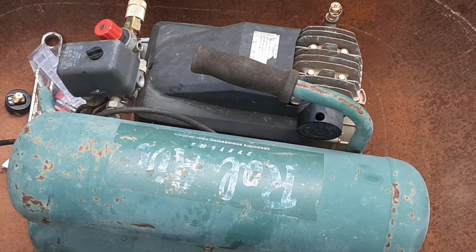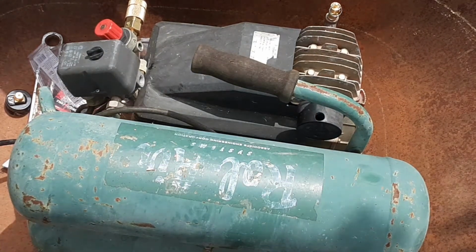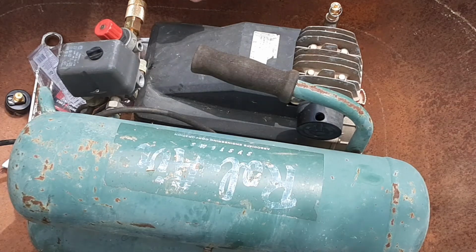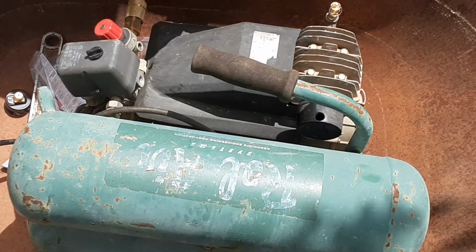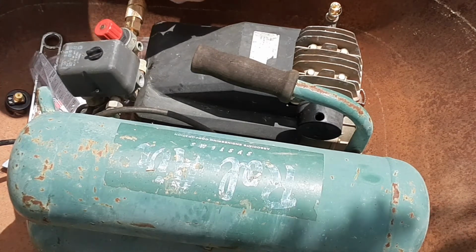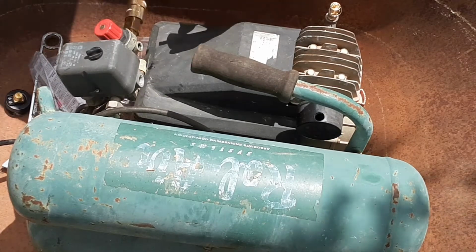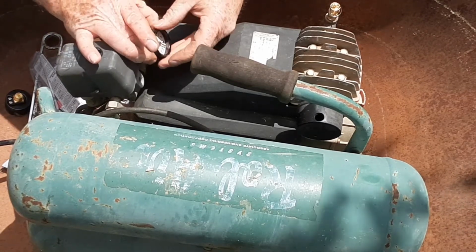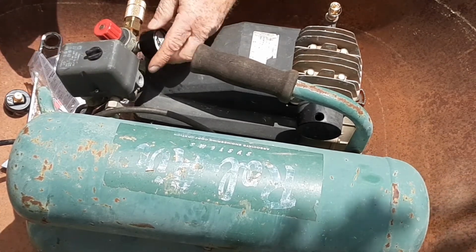Get this to stick to it. And what I always do is I always turn my Teflon in the same direction that it threads in. And what this does is it overlaps. If it'll ever get that last little wrap over, I just put a coat around it. Then you have to make sure you don't plug your hole, because that defeats the purpose of the air gauge. I wrap it around it so that when I'm turning it, it doesn't unravel it. And you're only going to have this Teflon in the low grooves when you complete this. It's not going to be in the high spots.